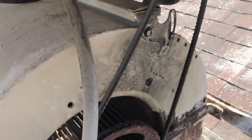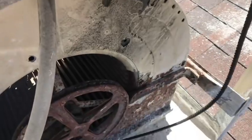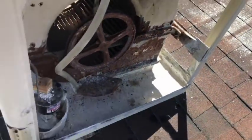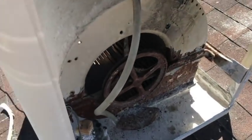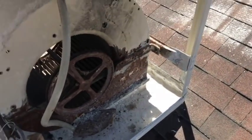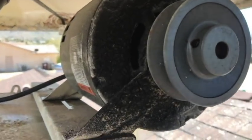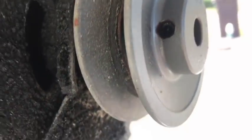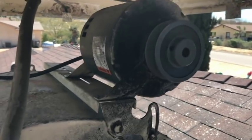As far as the belt, we cannot reuse this belt, but we might need to know the length, so we can cut the belt. That's a flat rate trick. We'll figure out the length of that later. So that's that. All right. The other thing that I brought up was a pulley puller. I did not bring up the diameter tool, and I forgot to bring a little Allen up. So I need to find a corresponding Allen that fits in that, so I can pull the pulley off of this.